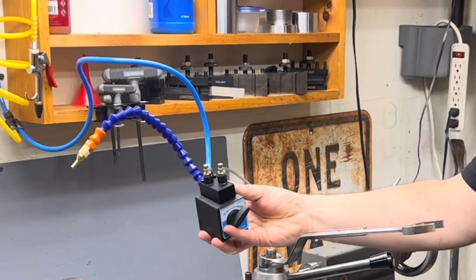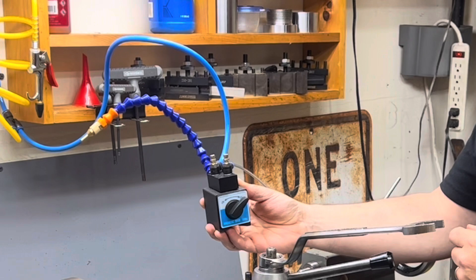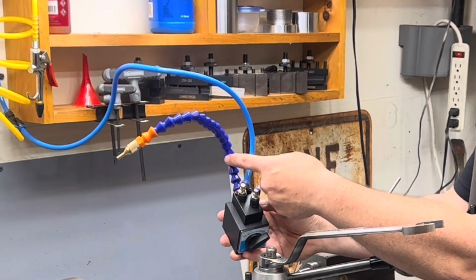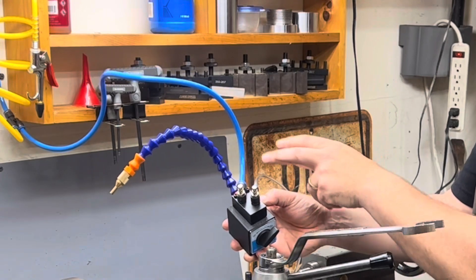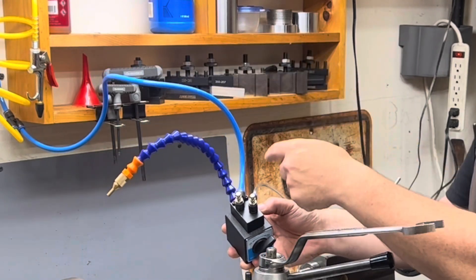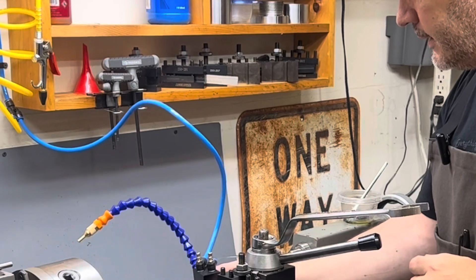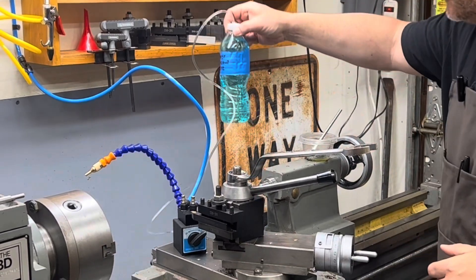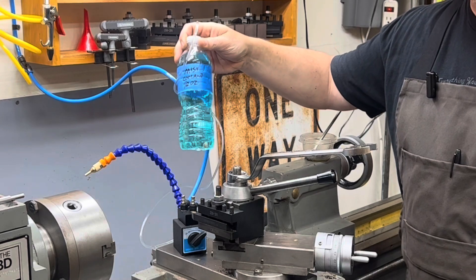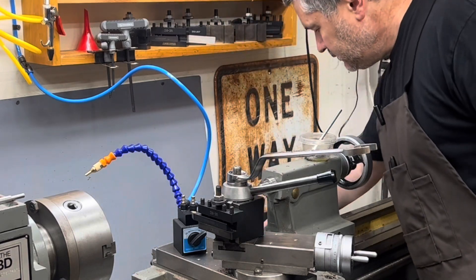Here it is, the way that I've set it up. I have a magnetic base from an inexpensive indicator holder where I've obviously since removed the holder part. This is the misting spray system, which comes with the adjustable spray arm and then the nozzles for your air intake. And also for the mist intake — this works on a siphon system. So as the air comes through and out the nozzle, it's siphoning the mist fluid from your container. In my case, I'm using just a small Poland Spring water bottle, and about a half an ounce of coolant is all that you need to mix with this 16.9 ounce bottle. So it takes very little.